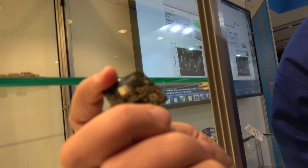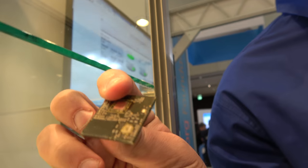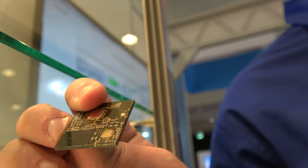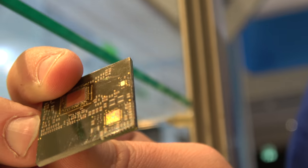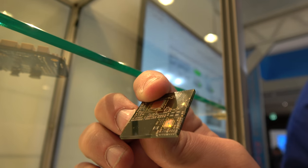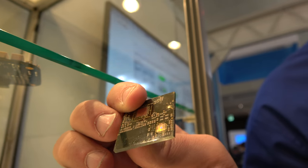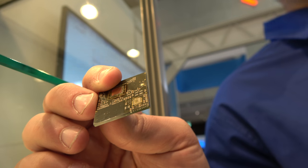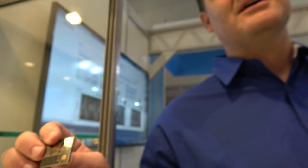By putting all this stuff into the SIP, you can do things with more affordable tools. This is the inside of the SIP — a special epoxied version to see what's inside. You've got four ICs: two for power management, the processor, and DDR memory. There are also 150 passives including inductors, coupling capacitors — everything you need to build a system.